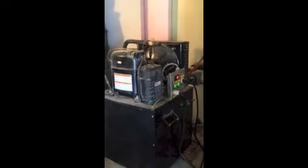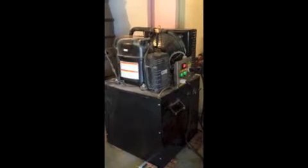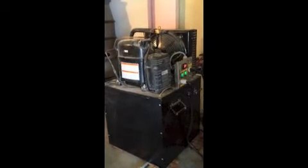Today we're going to talk about glycol systems for your fermenters. The glycol system we use is actually a line chiller that we get from Fox Equipment. This is the largest one — it's a three-quarter horsepower and costs about $1,800. It is enough to chill two of our seven-barrel fermenters.